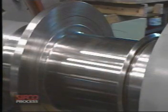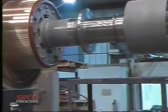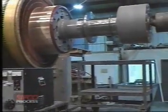The eleven and a half inch diameter journal by eleven and three quarter inch long fit is now seven thousandths undersized. The armature shaft will remain in the lathe and be rotated at 50 to 75 feet per minute during processing.